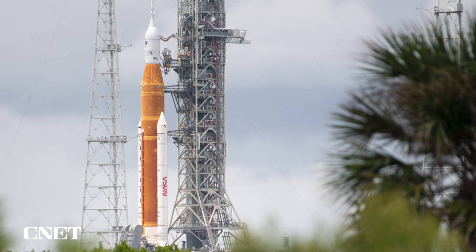Thank you, Tom, and good morning everyone. As you know, during launch attempt number two we had a QD leak — a quick disconnect leak on the eight-inch fill drain line at the TSMU interface. The team has done a fantastic job going through the data on what caused it and what mitigations we have. We changed out the seals on that QD out at the pad, updated procedures, and are now ready to get into our cryo demonstration.